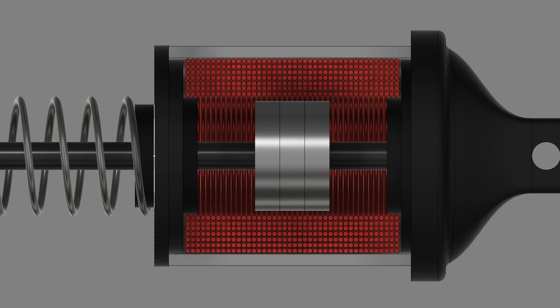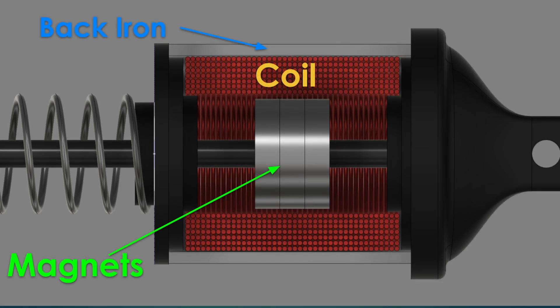These are the same common type of motors you find inside of most speakers. They're very easy to manufacture, they're very responsive, and unbelievably accurate. There are a couple of different configurations for a voice coil motor depending on how you build it. The voice coil I've designed is referred to as a moving magnet voice coil motor, as opposed to a moving coil voice coil motor.